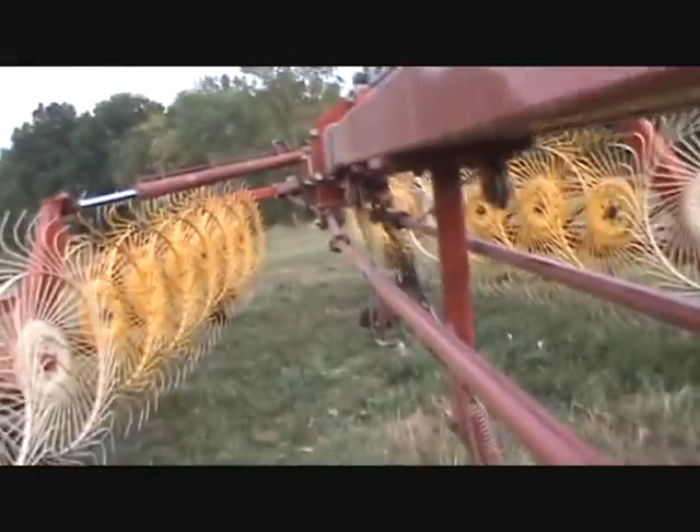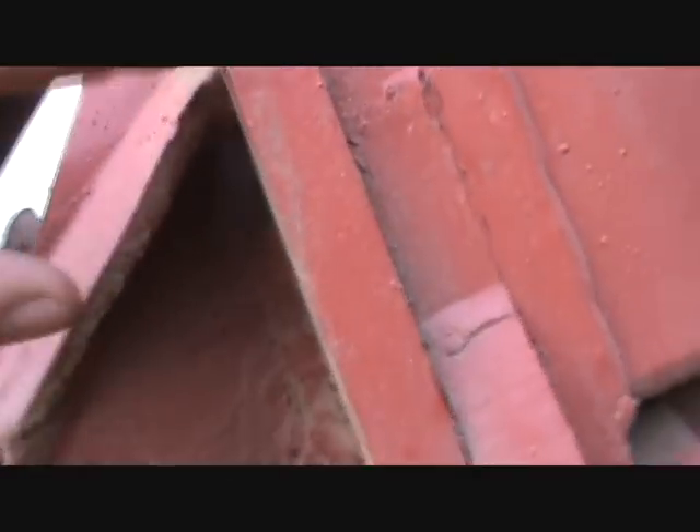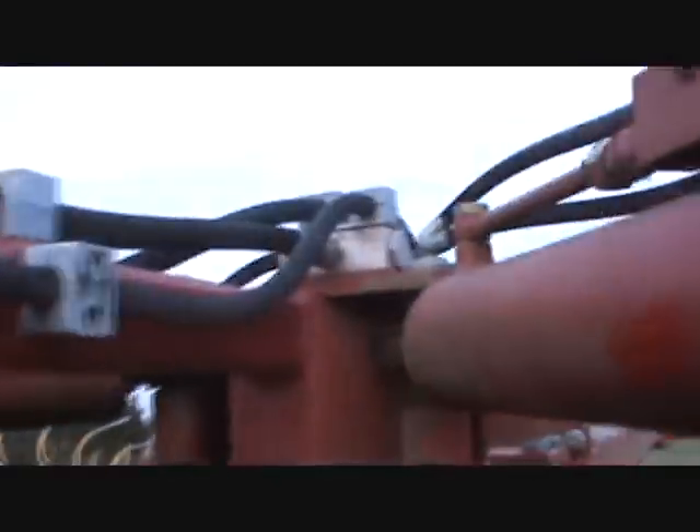This part here is supposed to be tight and it's loose, while this side over here is as tight as could be. You can see down the bottom how it's really twisted — it's headed straight down there and it's really off to the left. I didn't even look to see if this part was broke. I fixed this — I rebuilt this part this spring, put in a 5/8 inch plate where it had a 5/16, really beefed it up. It did not bend. From here forward is good, but from here back that whole beam is junk. We've also got a bent cylinder again.